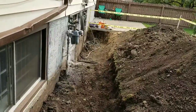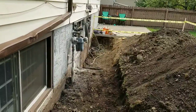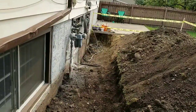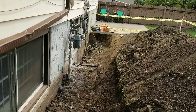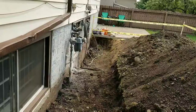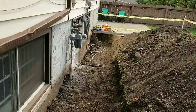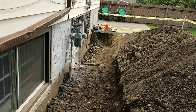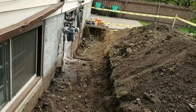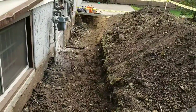You see over there, what I've been leaning on is an old set of gas lines. See how they're bent a little? So that means the bucket did hit them. And were those active lines that had not been checked on the inside of the house to ensure that they had an open plug or that they were capped off, then even just a scratch on them, you would contact the utility to come and have them check them, because you really don't want to have to redo a job like this. Cost you a bit of bread.